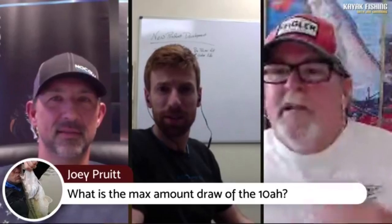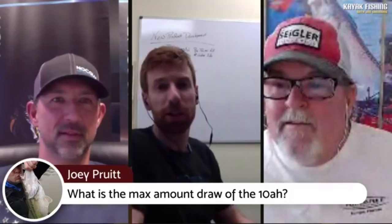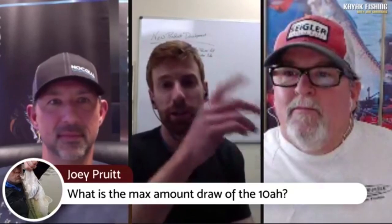What is the max amp draw of the 10 amp hour? It's really going to depend. The question I'm reading into is how long will it power a device. The basic math: take the capacity of the battery and divide that by the draw of the device. Easy math: if you've got our 10 amp hour battery and your device is pulling one amp per hour, you're going to get roughly 10 hours of power. What does a Dragonfly draw? It depends — on what bells and whistles you've got turned on, what the resolution's like, what the brightness level is. And that's a big one people don't seem to realize: bring down your brightness a little bit and your battery is going to last a lot longer.